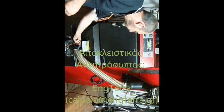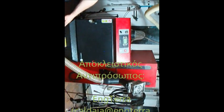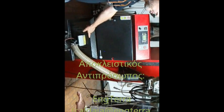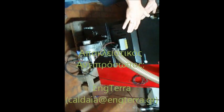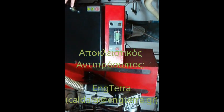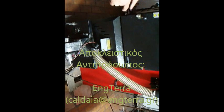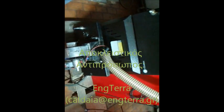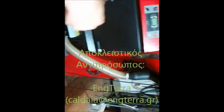In the combi system, when you switch the boiler on with pellet mode, the air inlet for the wood part is closed, and it opens the air in the pellet burner — doing the opposite. In many other combi boilers on the market, this is not happening, and it's a big problem, because when you don't close the air in the burner and you work with wood, you have a lot of uncontrolled air coming into the boiler through the burner.